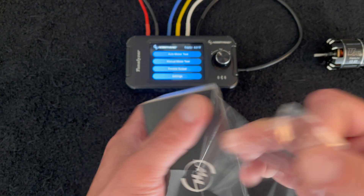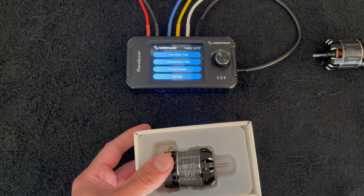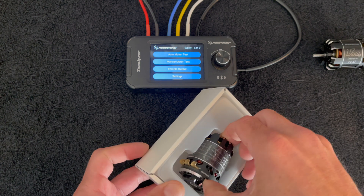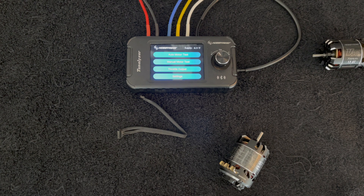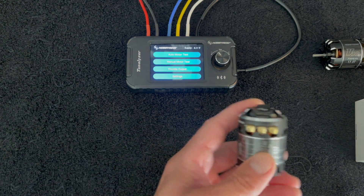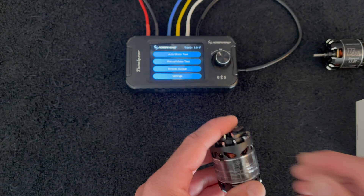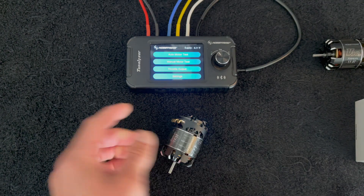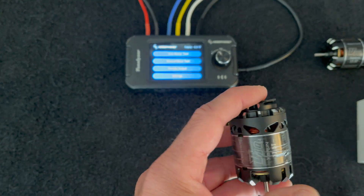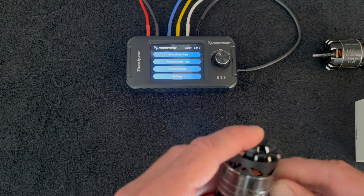In addition to just being a tune analyzer, the Tunelizer also acts as a Bluetooth module for your XeRun series of speed controls. So if you have like XR10s, XR8, stuff like that, you can use the Tunelizer to hook up to the Hobbywing app and do speed control adjustments and updates. The Tunelizer also can be used as a benchtop speed control tester — there's a port on the side where you can plug your speed control's input harness in and run the speed control up and down, so if you don't have a radio and receiver ready to go, you can use it as a benchtop tester.